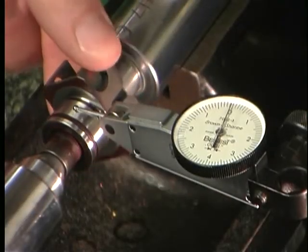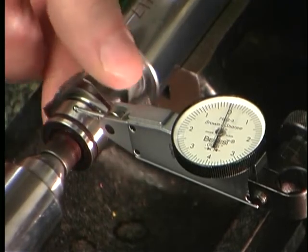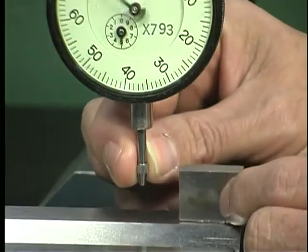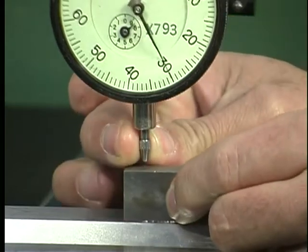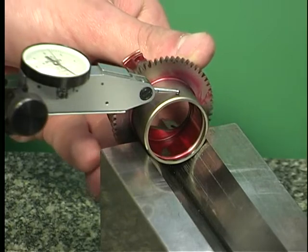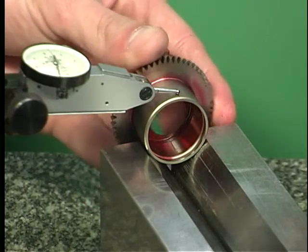Open Setup Inspection is sometimes required for first piece inspection after machine setup. It may also be necessary for very short runs for a prototype or one-of-a-kind workpieces, or in other situations which do not justify the cost of making production gauges.